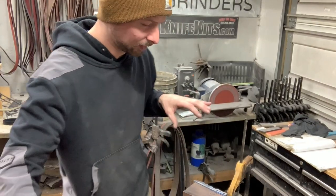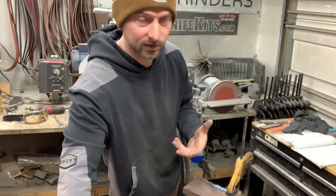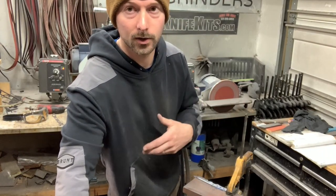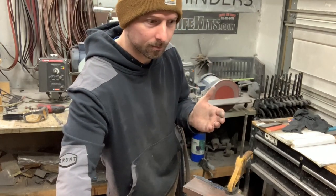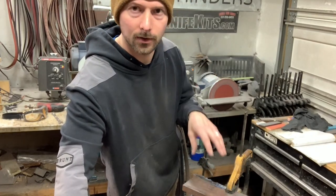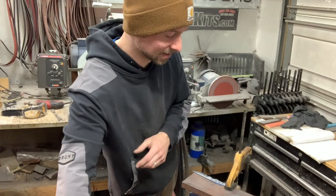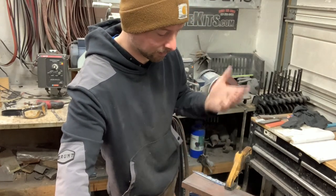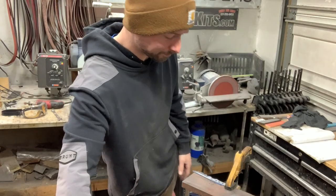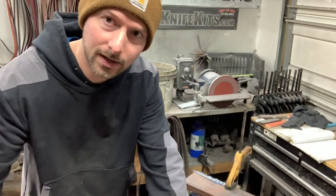So this is kind of the only downfall of working with this Damascus: technically you should take your time to hand sand it. If you wanted to finish this on the belt like we already did, up to 220, or maybe bring it a little higher and etch it, you'll get okay results. The finish will still look okay, but when you take it up to around 800 with this steel, it really gives you a lot more contrast in the Damascus. And for me, it's worth taking the little bit extra time to hand sand before etching. So take that for what it is. I'm going to get this side hand sanded, and then I will jump over to the acid tank and show you guys my etching process for Alabama Damascus.